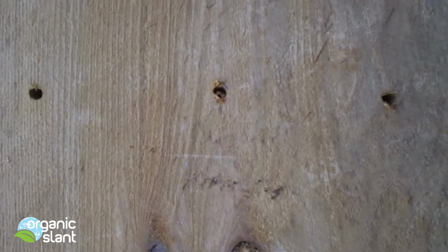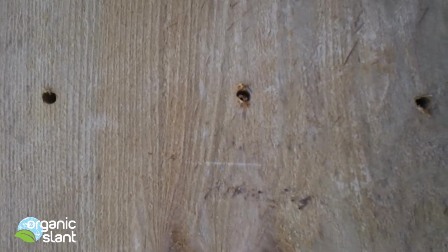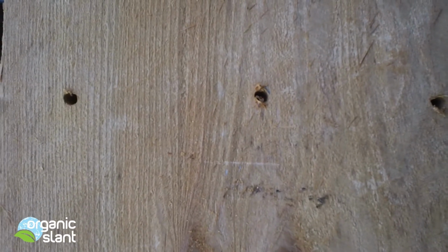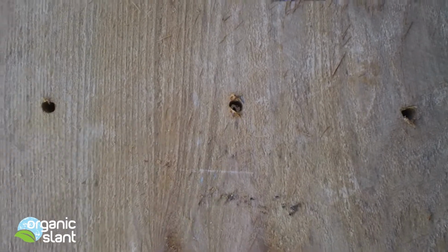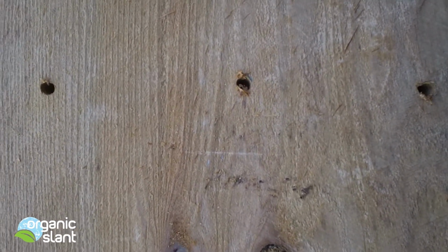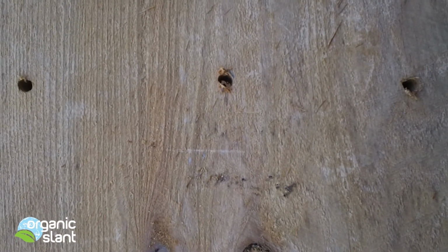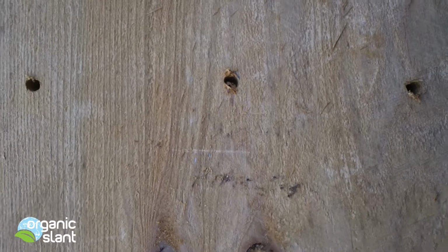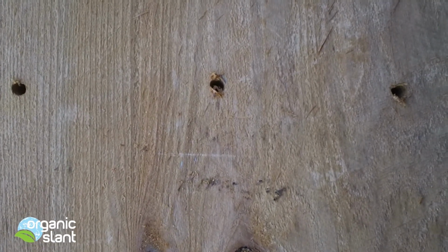Alright, there you go. The holes are drilled, and you want to go right through them. That's the best way to prevent the crack, because the screw's going to go right through there too. And you will also penetrate the 2x2 very slightly. Just, I would say, maybe 1/8 of an inch, no more than 1/4 of an inch into the 2x2 to start that one, because that could crack also.